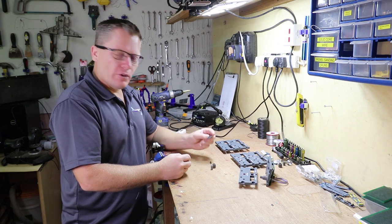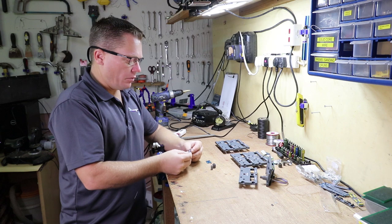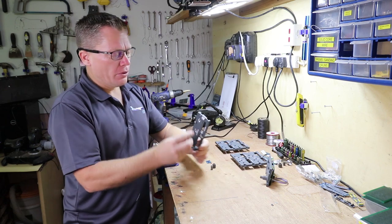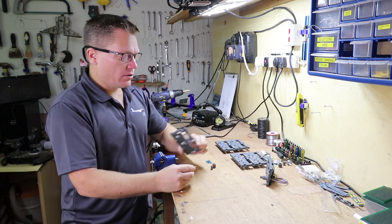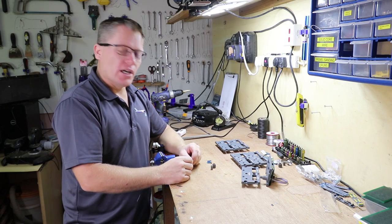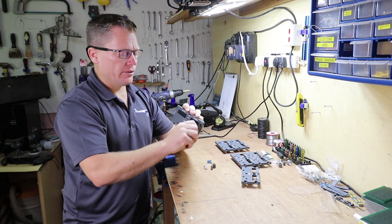With the panels assembled, it's now time to fit the encoder. And on the board in front of me, I can see they're from Prop Wash. Great little dual encoders, very cheap. The only problem is they're a little bit too small for the 5mm phase panels. So when you put them through, you can't get the nut on. To solve this, I'm not going to worry about the PCB. What I'm going to do is hot glue it straight into position, and it seems to work fine, as you can see on this panel here.